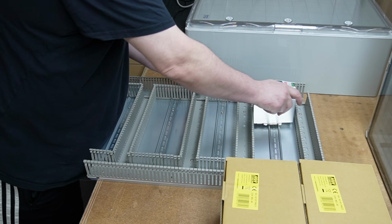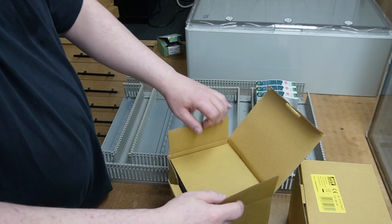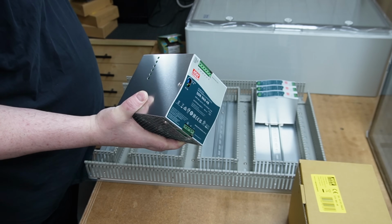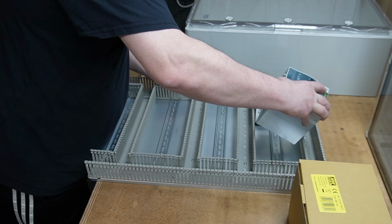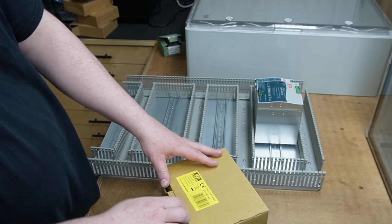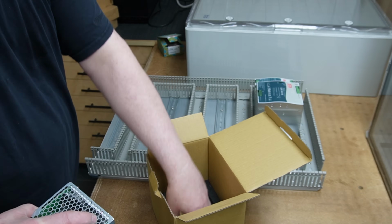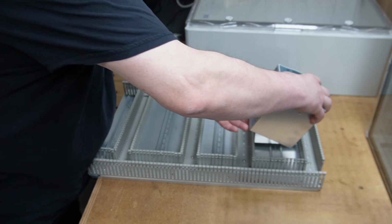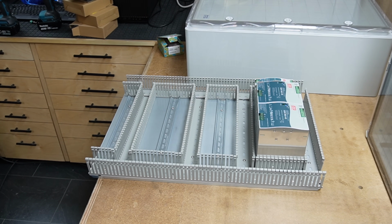Some people prefer to have one PSU per stepper or servo, but for me this doesn't make a lot of sense. First of all, 4 or 5 small PSUs are more expensive than 1 or 2 large ones. Secondly, steppers and servos have a back current flowing into the PSU when they decelerate. These PSUs can withstand 130% overload. So when you have 1 PSU per servo, that is your margin. But often the motors don't decelerate at the same time. So when you have a larger PSU serving 2 or even 3 motors, and one decelerates and the others don't, your margin is much higher.